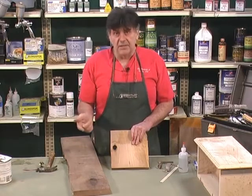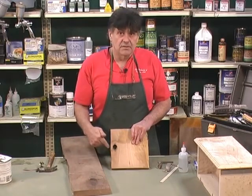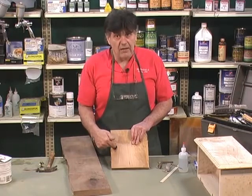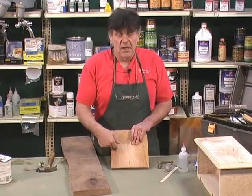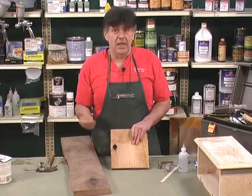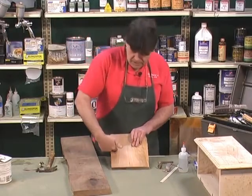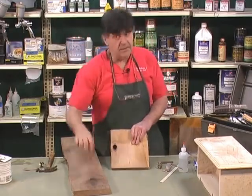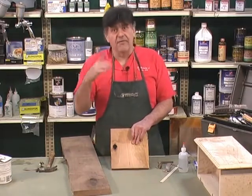And you know, particularly in some of the pines and any wood, you're going to see the knots that are loose. The best way to handle that is simply try to get the knot out. Clean the sides of it. What is a knot? A knot is simply end grain. It's a branch growing through. That's exactly what this would have been. It would have been a branch coming out. Same thing here. It's end grain coming up through a flat grain.